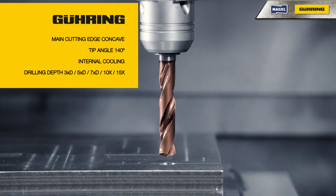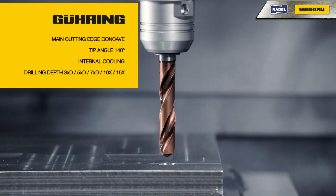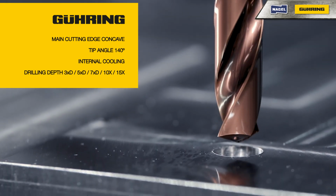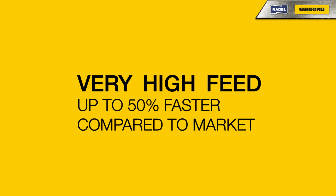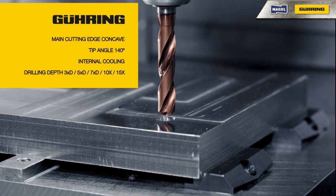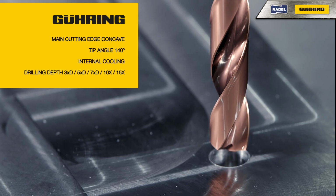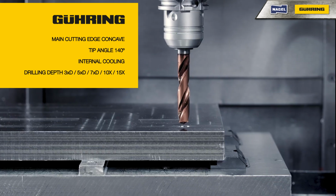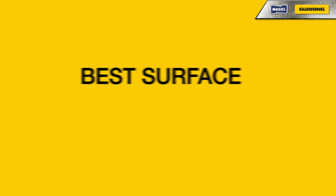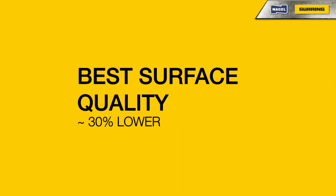This machine is powered by Gühring RT 100 Inox Pro drills. Engineered for top performance. Experience very high feed rates, up to 50% faster. With a concave main cutting edge, a 140-degree tip angle, internal cooling, and a drilling depth of 15 times the diameter, they deliver exceptional results. And get the best surface quality with up to 30% lower roughness.